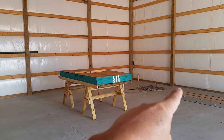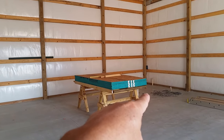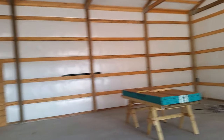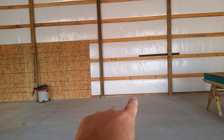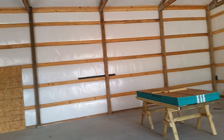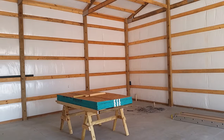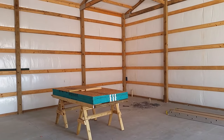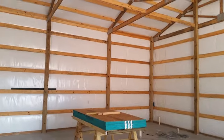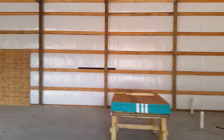It will come out 13 feet and there'll be a bathroom over in this direction. There'll be a shower there, there'll be sinks. This will be two stories high, so there'll be a set of steps that will come out of this room, go up this way and then come up this way, and then you'll be on the second story. It's 14 feet total, so I'll make the downstairs ceiling probably about seven-six, and the upstairs about six-four. You won't need as much headroom upstairs, but I do want it high enough that I don't hit my head.